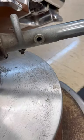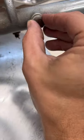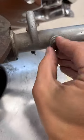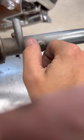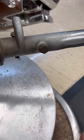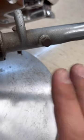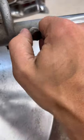Now I'm going to put my little keeper bolt in there. All this stuff should be oily and well used. Pretty much everything on barber chairs, the hardware should go in and out fairly easy. So if you're having to put a lot of tension on any of this stuff, odds are you're probably cross-threading it.